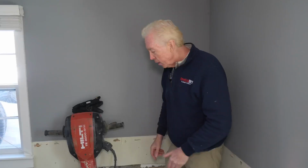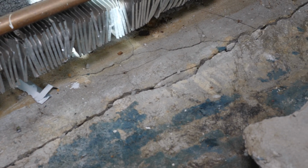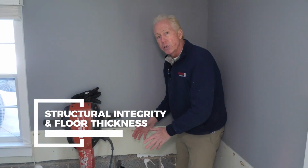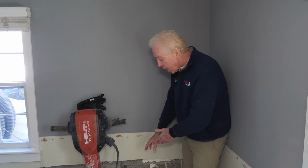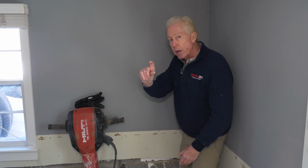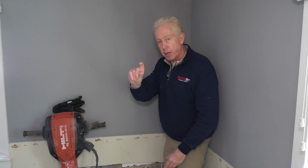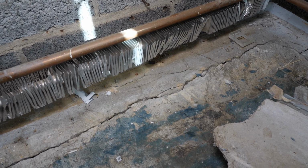waterproofing your basement. If you look here, you're seeing cracking where they re-cemented to put their system in all the way along there. That's because this floor has been taken off the footing and it lost the support of that footing. And in so doing, this floor can move and settle, and then it's not going to be supported by the re-cementing of the floor. If you look there, as we take out the pieces of concrete, that floor that they re-cemented back on is about that thick. So it's not giving any support to the existing or the main body of the floor.